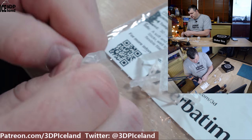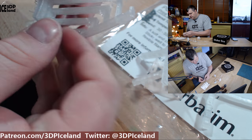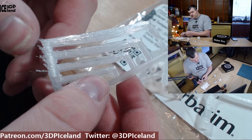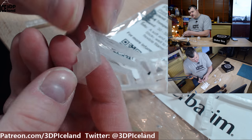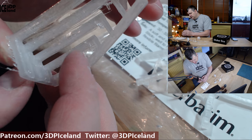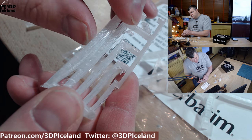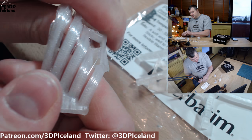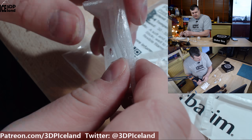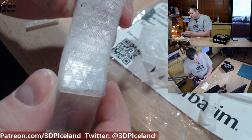This material has very good mechanical applications. I printed out a bridging test and it wasn't looking very good — there were some artifacts and issues. Bridging came out decent on the shorter bridges, but the longer bridges had quite a lot of drooping. Since this is just like rubber you can twist without damaging the print, bridging is maybe not the best application for this filament.